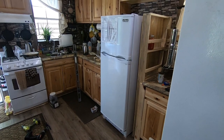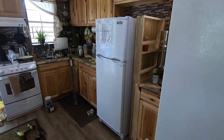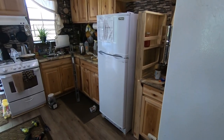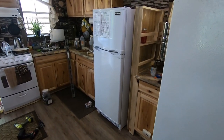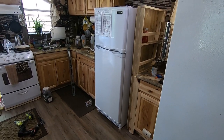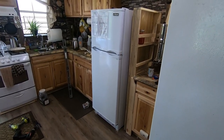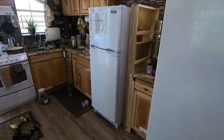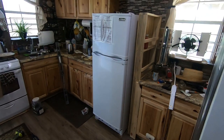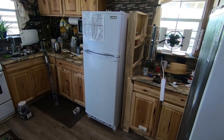By not using the battery bank for the fridge, it's going to last a long time. My goal now, instead of seven years, is to get over a decade out of it. I've got a boat with AGM batteries that are almost 20 years old just from barely using them and keeping a trickle charge on them. Solar is not the end-all — it's just another accessory and another tool in the toolbox.